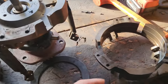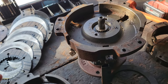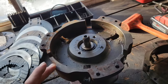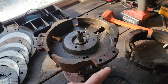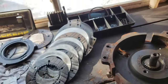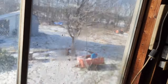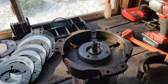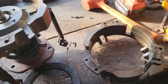Then we'll get another casting, and something I knew this, but completely spaced it. It's a D17 casting, and there's one less clutch per side. There's one less in the low and one less in the high, so the castings are different. Anyway, long story short, I've got a D19 chassis down there that I got from Ted when I did his LP D19. And we're hoping that the casing is good in that.